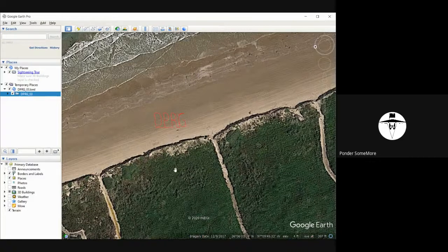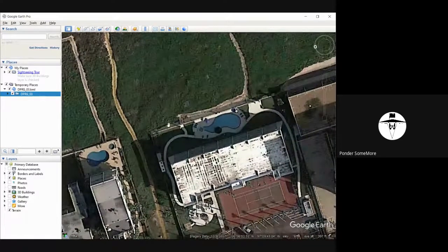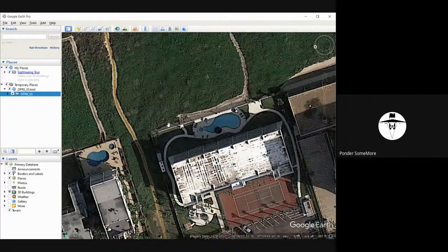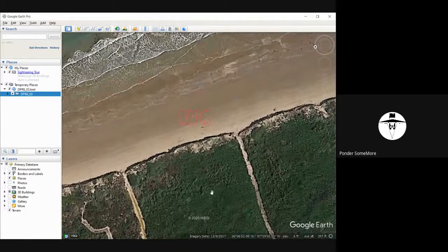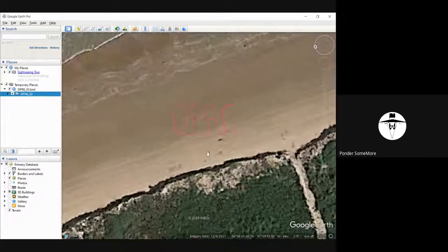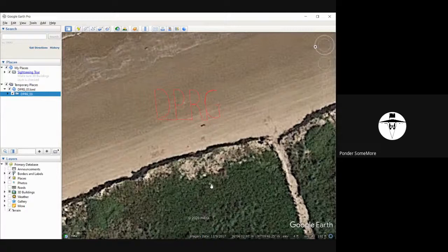Another problem was that for some reason, with the base station I had set up right here, I was only able to get float RTK accuracy, which isn't the same as a full RTK fix. So the accuracy was probably around half a meter. It might have been okay. It would have been a pretty wobbly looking little logo, but it might have worked. But when I'm using that base station I found in Richardson here in Dallas, I'm getting a better fix. So I'm going to look for a dirt baseball diamond, maybe, where I can try this out locally.